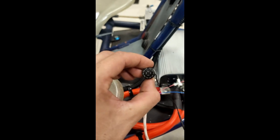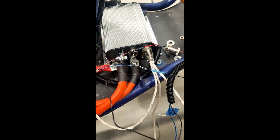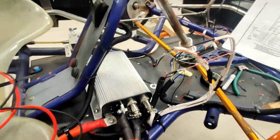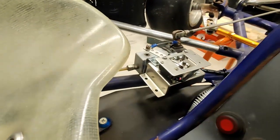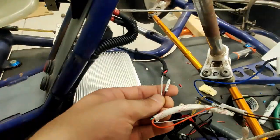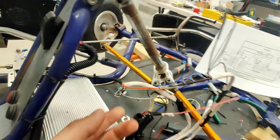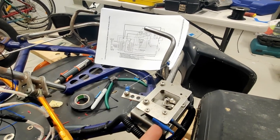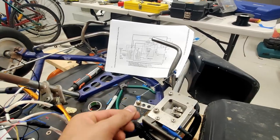I think the last little thing was soldering this pin on J1 of the controller. I've done a quick wiring of everything for testing. All right, that's the wiring pretty much complete. I'll try to quickly explain. On the brake side, all we're using at the moment is the micro switch, and that's coming in with the return and this one which says brake switch. On the accelerator side, we're using the same thing, micro switch and the 5k position, so 0 to 5k throttle position.